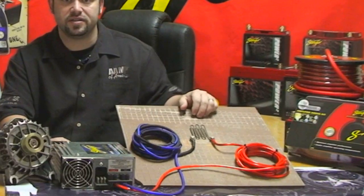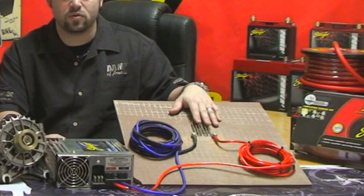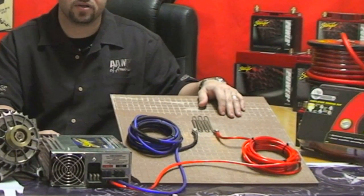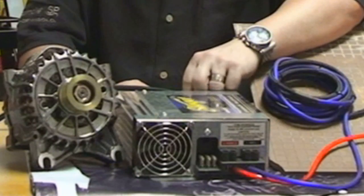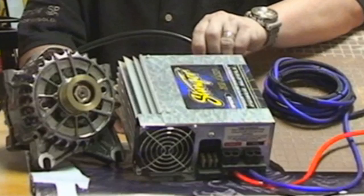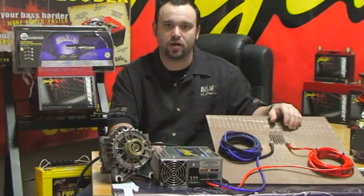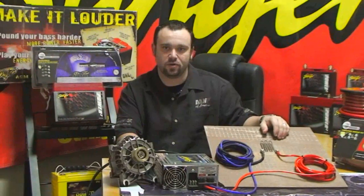In line with the wire is a 125 amp resistor coil. I chose a 125 amp coil because I want to keep the coil energized for extended periods of time, and I want to show the limits of the wire and not the coil. To power the circuit, I'm using a 70 amp Stinger power supply. This ensures I will only be transferring 70 amps of current on the wire, which is the maximum recommended for a 17 foot run and 8 gauge wire.